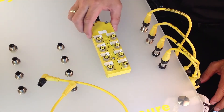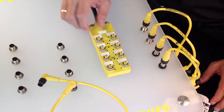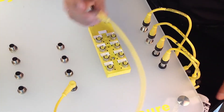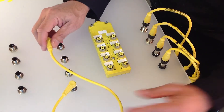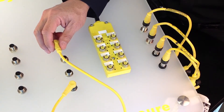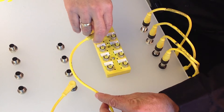This pre-made junction box has, in this example, Ultralock and M12 threaded connection connectors in their ports, so it accepts both the standard M12 threaded connection and the Ultralock. And to show you the benefits of the fast, simple, and secure connection that the Ultralock can provide, let me show you in contrast how it looks against an M12 threaded connection.